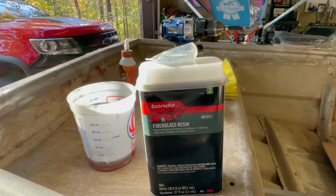And if you do use that, I'd like to point out that it's going to really put a thick layer of coating on your transom. So if you're going to go that route, make sure you cut your transom a little bit narrower, width wise, or you're going to have trouble getting it in. I ran into that problem with the very first boat transom I replaced.